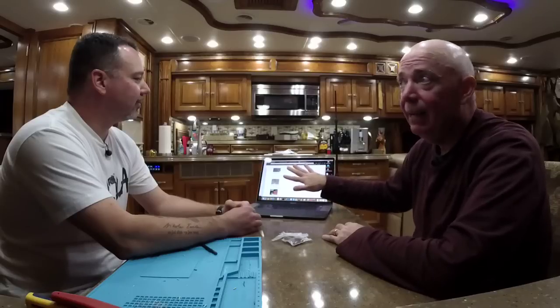The hardest thing, in my eyes, is the program settings you have to set, because the thermostat has so many different program settings. They don't know how it's going to be used or the situation of the home it's going into. So they have all these different settings, and once you have them set correctly, it will work in a motor coach. That was part of the difficulty, figuring out which settings have to be set in which way so the connectivity of the motor coach wiring would work properly.